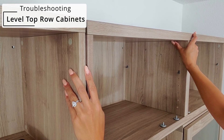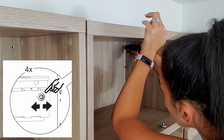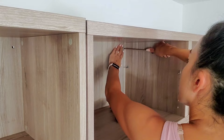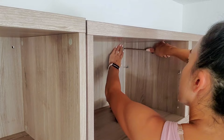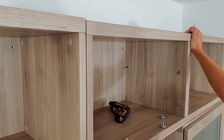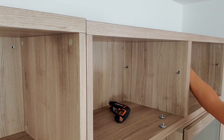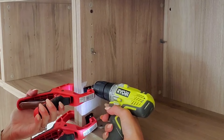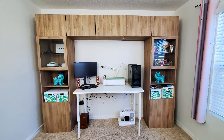Now that I have my towers in place, I am comfortable locking in all the top row cabinets to the suspension rails. But I did need to troubleshoot to make a straight line. There is some wiggle room in the channel to move the cabinet, but when I was screwing the cabinet onto the suspension rail, it started to pull apart — the tighter I screwed it in, the more the gap increased. I removed the screw and checked which holes aligned better with just a Phillips screwdriver, chose the one that lined up best, and screwed it in first. Then I held the cabinet into position, clamped it together, grabbed some extra wood screws making sure they wouldn't go completely through the other side, and after screwing in the top screw, moved the clamp to make sure the second one wouldn't create another gap.